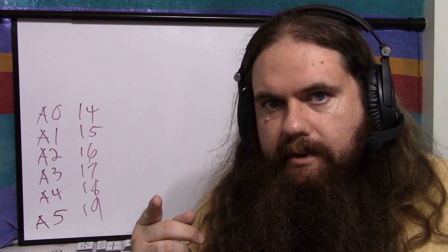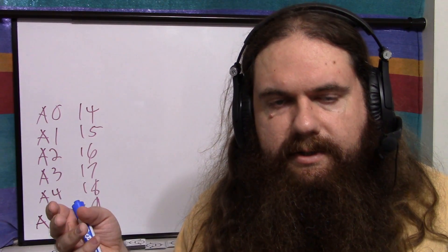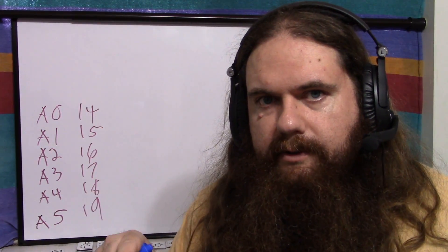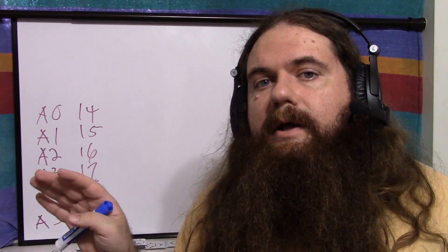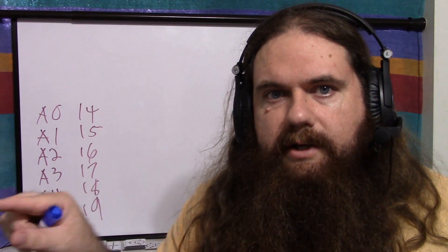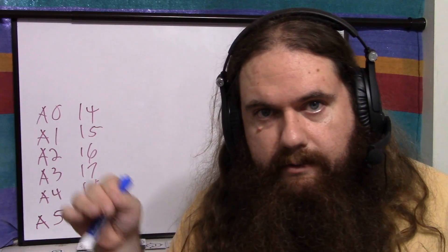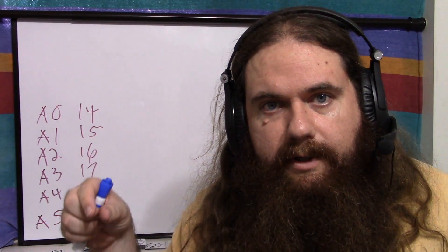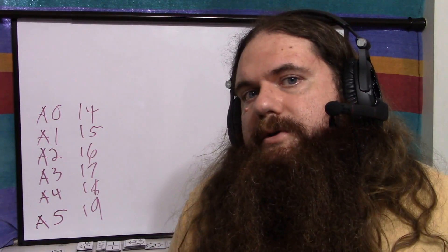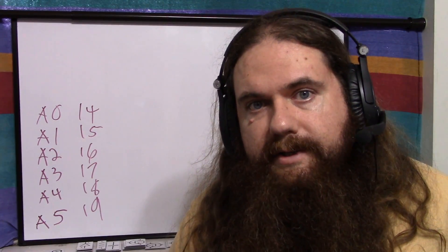If you're not using the serial port, you can use these pins for other things. Normally you plug in the USB and upload sketches, do diagnostics, serial monitor and so on. But if you never turn serial on — if you reboot and your code never turns on serial — you can use pins 0 and 1. However, they're connected in a weird way with resistors, so you have to do shenanigans to get it to work right. Also, you can't use them while testing, because if it's plugged into your computer you're already using pins 0 and 1.